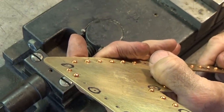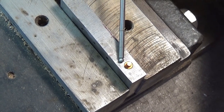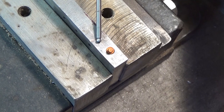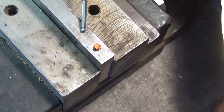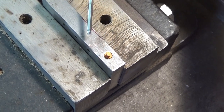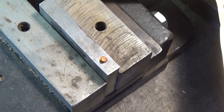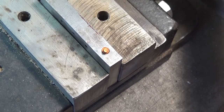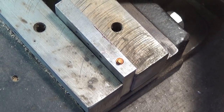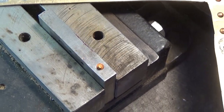Let me zoom in. All right, Bob — what sort of drill bit did you use to get a spherical hole on that metal bar? It actually turns out to be a standard 118-degree included angle drill bit — the stuff you buy at Home Depot or Lowe's. Those drill bits, even though they're 118 degrees included angle, which isn't spherical, by the time this rivet gets mashed in there and centered, it is for all intents and purposes circular on the top. The problem is getting this hole exactly the right depth. If it goes too deep, you can't mash the rivet on the backside because it allows the rivet to pass too far into the block and you can't get a good mash. On the other hand, if it's too short, then you distort the head of the rivet and you mash the head out — you get that mushroom thing where it flanges out like the brim of a hat. So this is a very critical distance.